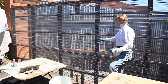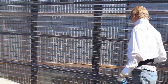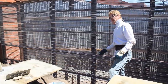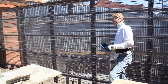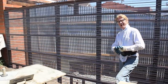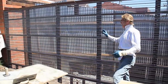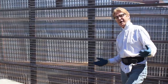Today we're going to stucco a wall. The camera may show what's behind this - it's 3.4 high ribbed lath, we've got 4x4s sunk in the ground with cross members. A friend of mine said he was going to dig down two feet, set CMU blocks, rebar them, and fill with concrete for a structurally strong wall. I said why - it sounds like you're trying to build a Vatican wall. I told him I've got 50 ways to do it if you want to save time, money, and effort.